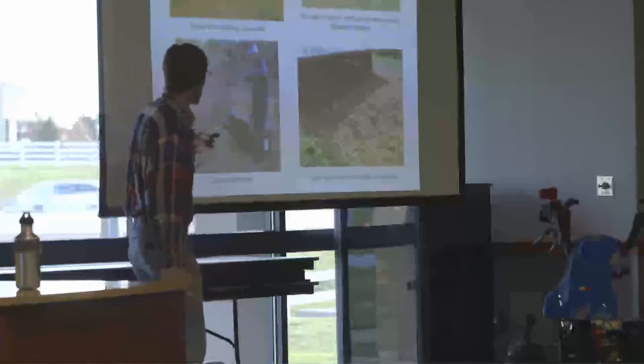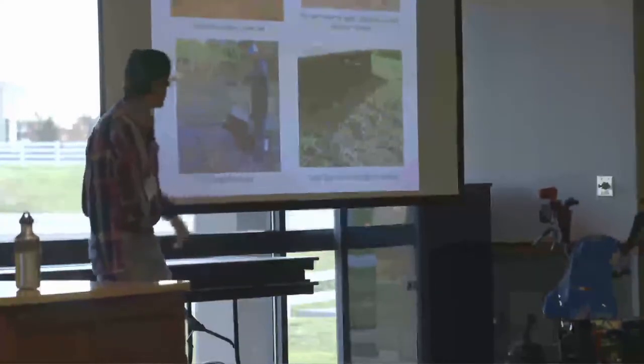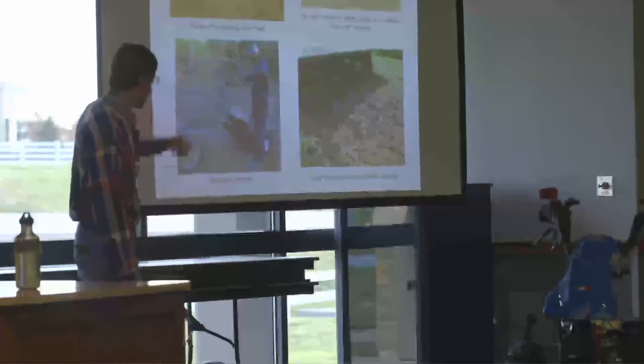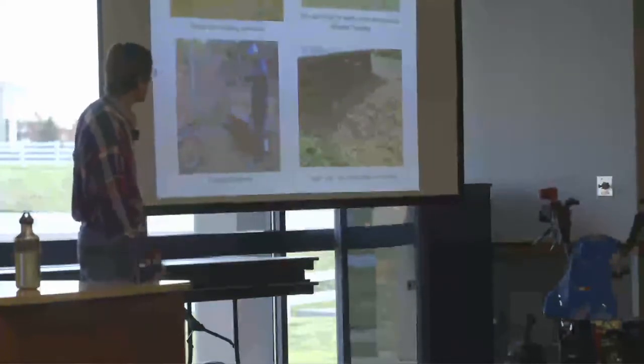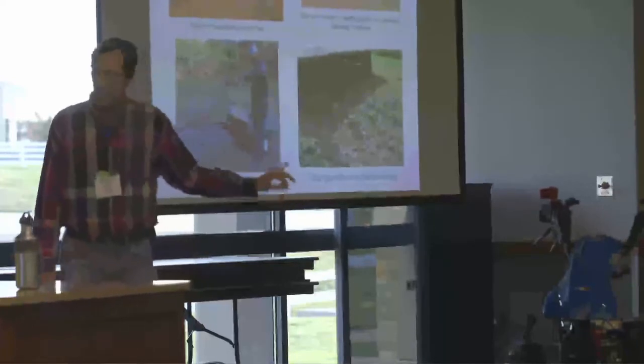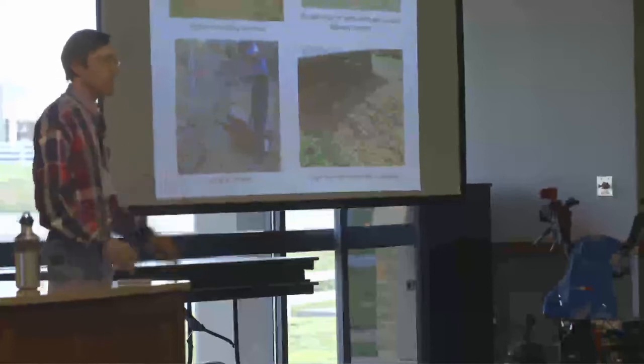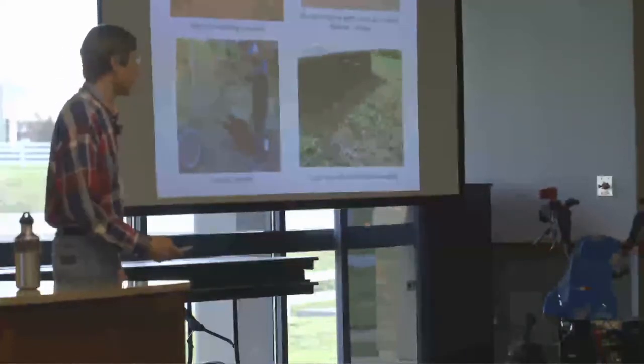They just came out with a compost spreader. That's actually made in Pennsylvania, just adapted to a walk-behind tractor. It's a ground drive thing. There's no PTO shaft. It just runs a little conveyor belt and drops the compost out the front. Don't confuse it with a manure spreader, though. People have tried to put manure through those things, and something that clumpy is not going to go through it. It has to be pretty well-done compost.